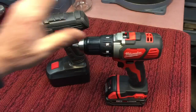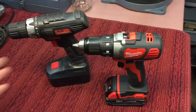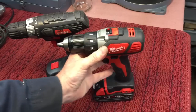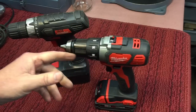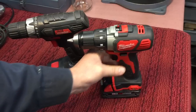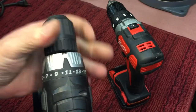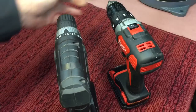When you move up to the more expensive ones, you're dealing with decisions like: this one's a hundred, but for $175 I can get one that's brushless — do I want that? These are much heavier drills but more commercial duty, better made, better components, better chucks, more accurate, and they run longer because of the lithium. One feature you'll find on the cordless but not on most corded drills is the clutch — it'll stop the drill and start to slip so you won't drive a screw in too far. It's a great thing to have for woodworkers.